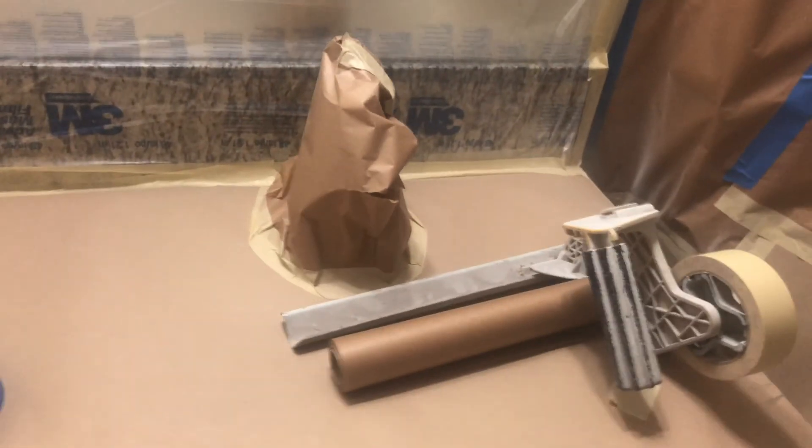The next thing you'll notice is a strip of paper along the door frame. In this case, the bathroom was located off the kitchen where we were also spraying so I could leave the door open, but normally we would want to close the door, so this piece covers the door. I've covered the entire wall and mirror with a single length of 72 inch plastic — this is the quickest and most efficient way to do this. If we are not demoing it, I cover the counter with paper and wrap up the faucet as well. The floors and the inside of the cabinet are masked off just like you normally would on a kitchen.